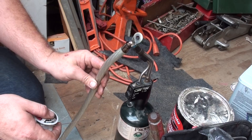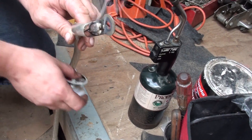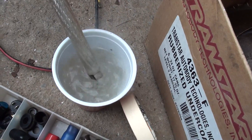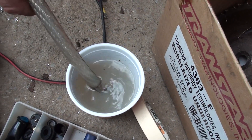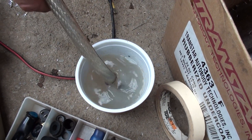Now we're going to heat that up and let that drop. You just seen how much solder I put in that — it disappeared. We're going to cool it off with some water here. See, it's H2O soluble, so whatever's loose comes back off as far as the flux goes — whatever did not get sucked down in there with the solder and the chemical reaction.